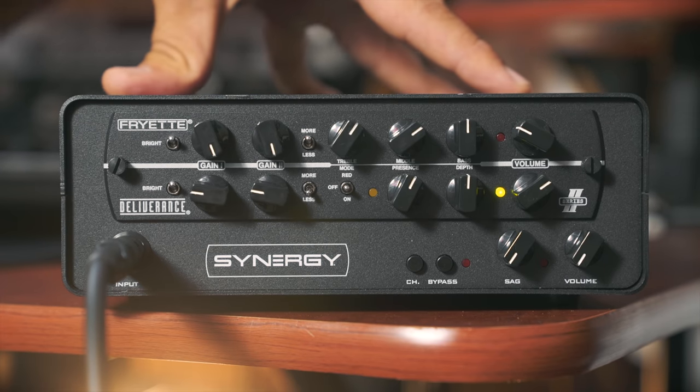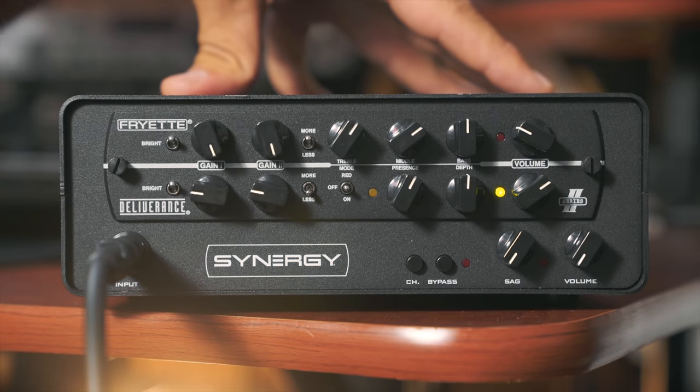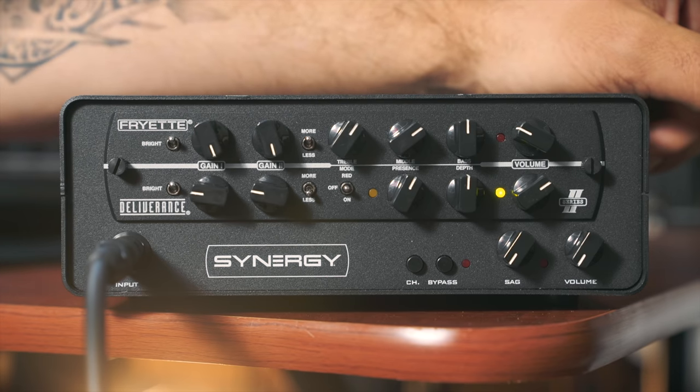But in this video, we're looking at a slightly different product. We've got a new preamp, the Fryette Deliverance preamp, which we're going to take a look at in a moment, but we're also housing it in the Synergy SYN1, this awesome little housing for any of the Synergy preamp modules, which allows you to insert the preamp modules into the effects loop of an amplifier, which is really cool. In a similar way to the Victory V4 series, how you can get the Kraken, put it in the effects loop of any amplifier and essentially slave any amplifier's power section and run that preamp. It's exactly the same with this. Use SYN1 in the effects loop of any amplifier to use its power section, and you can get that kind of raw valve power, but use any preamp module you want. So it's really, really cool.